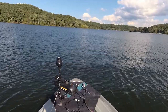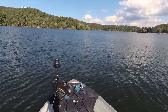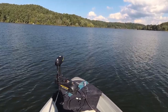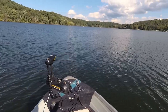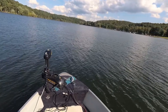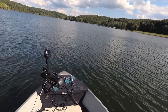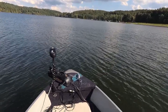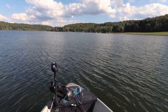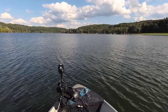I've got it set on a navigational heading right now, and that is my favorite feature. I like it because when I change the direction I want the boat to go, the trolling motor locks in on a heading and will do everything it can to maintain that heading. As wind affects the boat, current affects the boat, or wake from other boats affects the positioning — the trolling motor will constantly correct for all of those things and try to keep the boat on that heading.